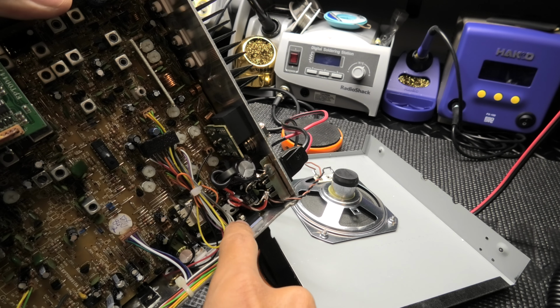Let's see what 2 watts gives us. If I put this at 2 watts, right there's about 2 watts. Flip the amp on. That gives me almost a 20 watt dead key. I definitely wouldn't go any more than that. So definitely somewhere between a watt and 2 watts set your dead key.